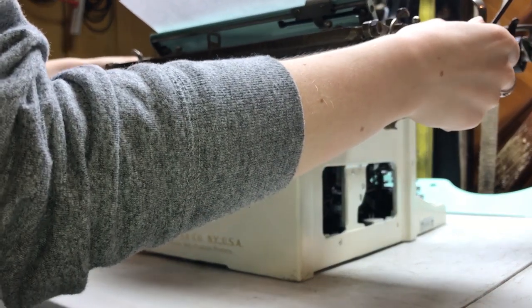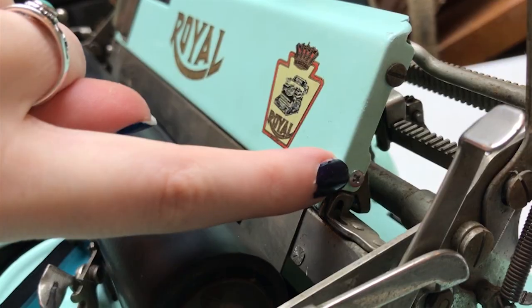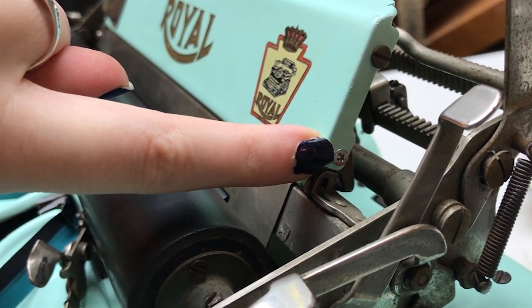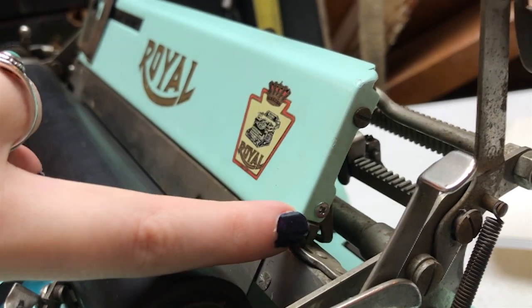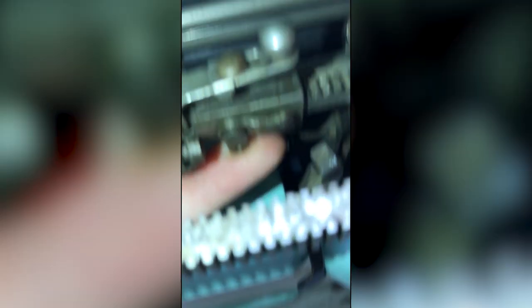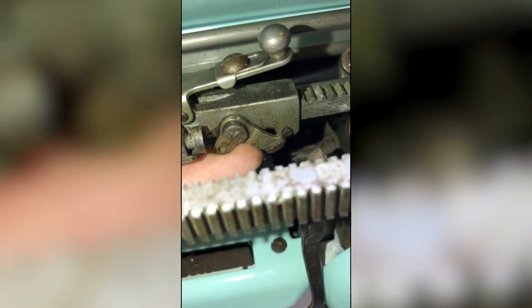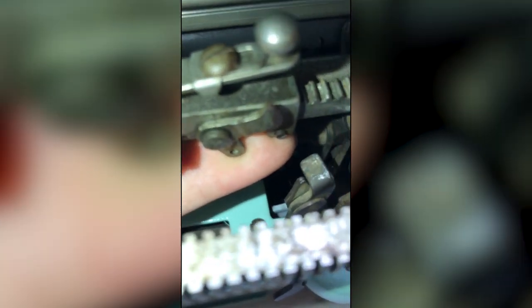I also adjusted the tension of the mainspring so that the carriage would have enough tension to type to the end of the line without running out of steam. Once I had this figured out, I discovered the paper tray really wasn't held in place because I was missing two screws. So I broke out my parts machine to find two tiny screws to hold this in place. And the bell didn't work. I first discovered I was missing a spring that attached the bell arm to the post in the back, so I ordered one online but broke out my parts machine and found a spring that would fit. It still wasn't working — it turns out the little arm on the bottom of the margin set wasn't hanging low enough to alert the bell that it was hitting the end of the line. Once that arm hung down it was in a better place to align with the bell arm, and I finally had a working typewriter bell.